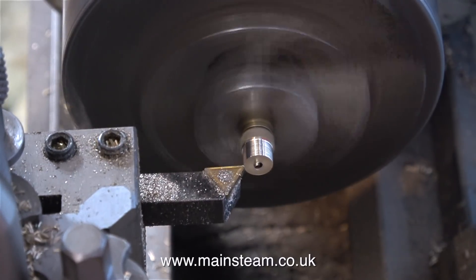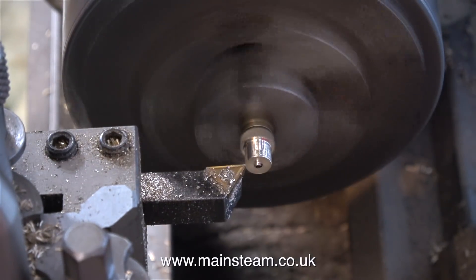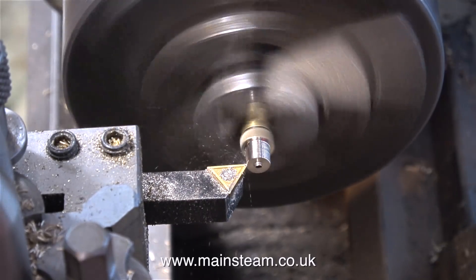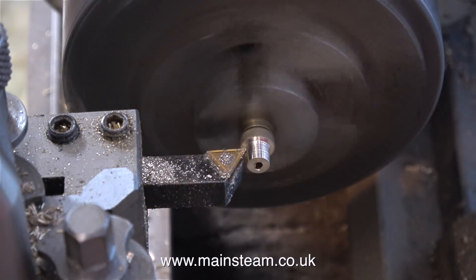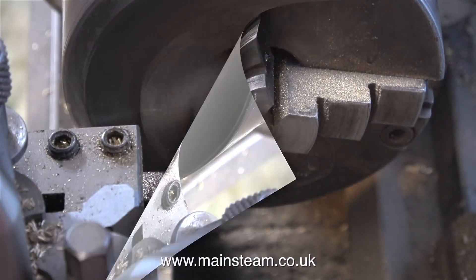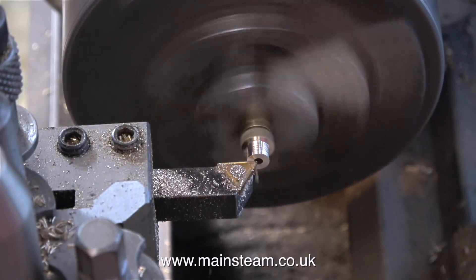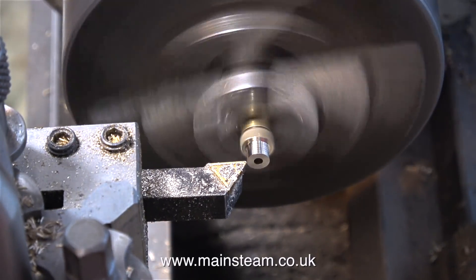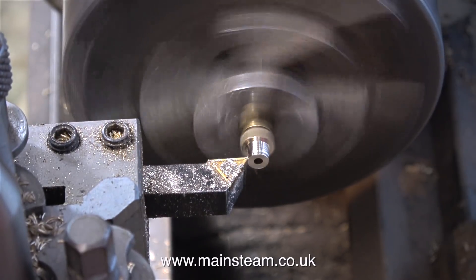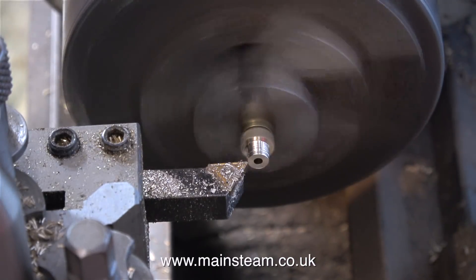This is a very lazy and possibly not the most accurate way to machine a steam fitting. If I was a proper engineer, I would put a piece of brass hexagon in the chuck, drill it tapping size for quarter by 40, then thread the piece of hexagon bar in the chuck quarter by 40 threads per inch, and then screw my fitting into that. That way everything would be perfectly concentric, but as this is not a precision item, the union nut is more than satisfactory, and more importantly it takes a lot less time to do it this way.